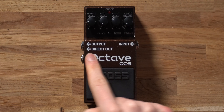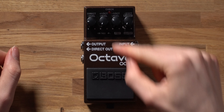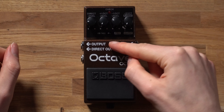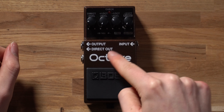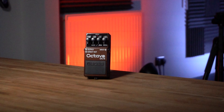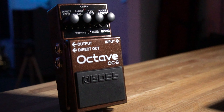If you want more control and flexibility, you can use both outputs simultaneously. The main output carries exclusively the sub and octave effects — the bass guitar sounds — while the direct out carries a clean signal of your guitar. This means you can give a front-of-house engineer two separate feeds: one with octave effects and one clean, giving them full control over how to direct each signal to subwoofers or EQ it further on the mixer for premium sounding results.